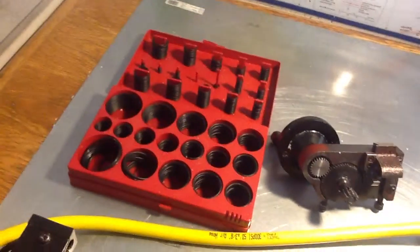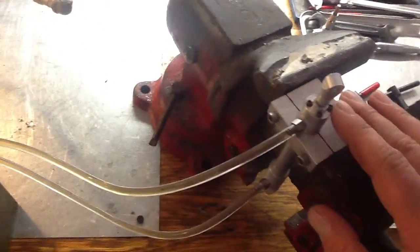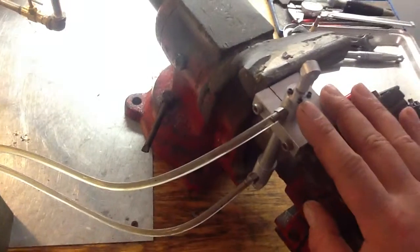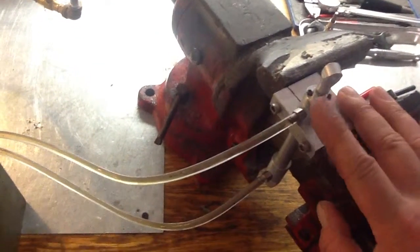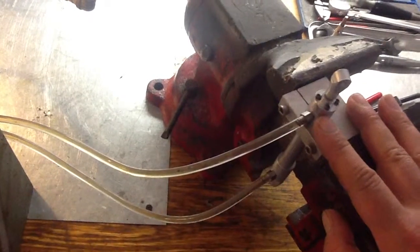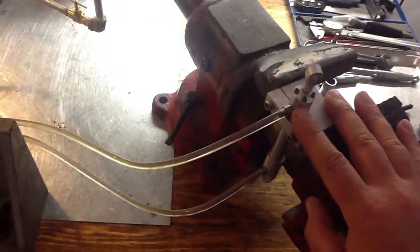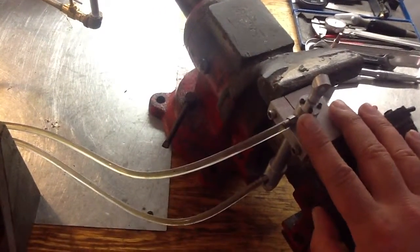The last thing I got was the O-ring kit to build some seals for it. What I kind of like about this design is that it can be overhauled. It's got a head here that you can unbolt and open up and replace the O-rings or clean it or do whatever. So it's not a one-time deal — you can open it up and overhaul it, which is great.